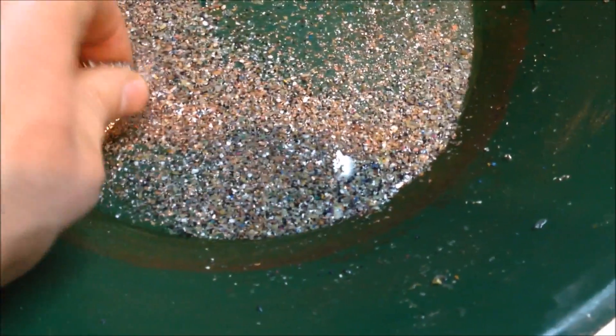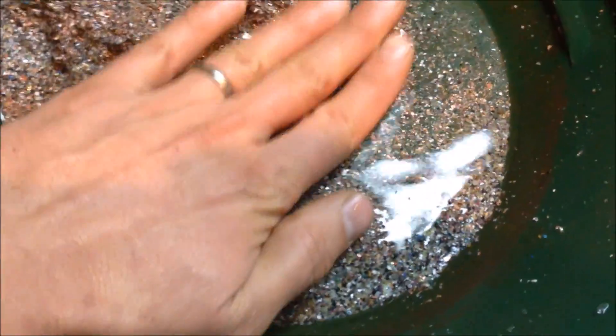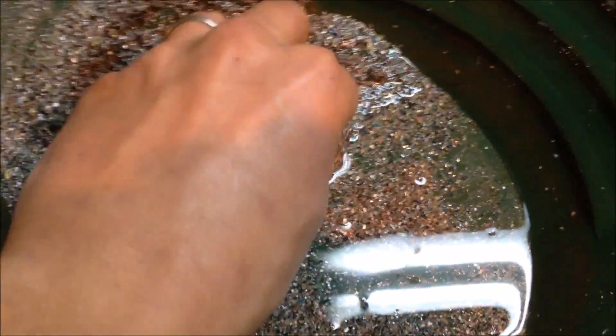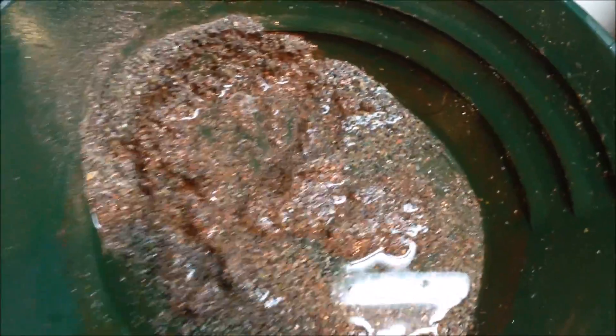Here's a sample out of our number three hole, or the middlings hole. You can see there's a bunch of copper in there, but it's also mixed with a bunch of boards still. For this first trial run, we didn't really have the splitter in the right place between the middlings and the tailings. You can probably clean that up quite a bit just by adjusting the splitter, and this can be rerun on the table again and upgraded even further — you can get it quite a bit cleaner by rerunning it.